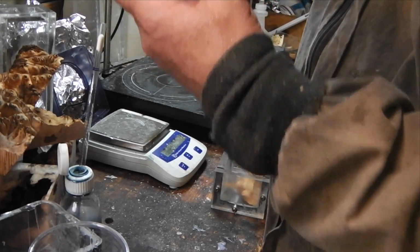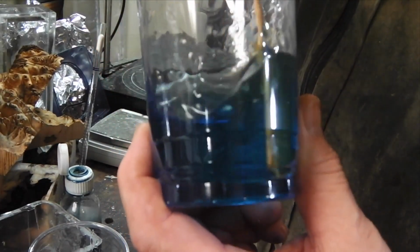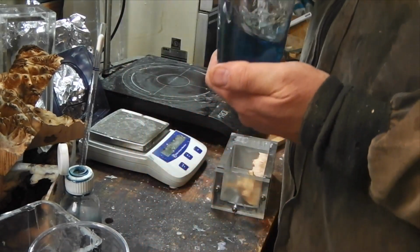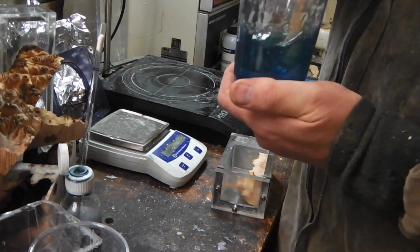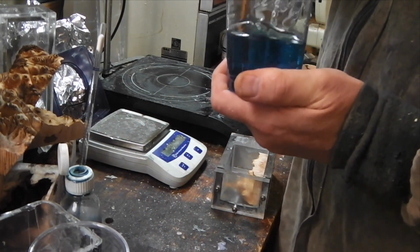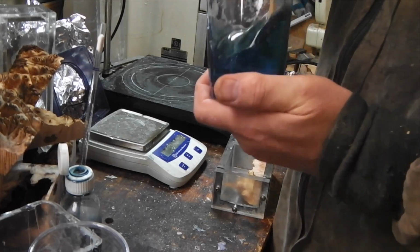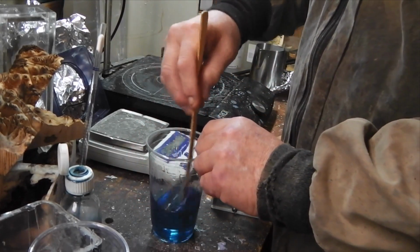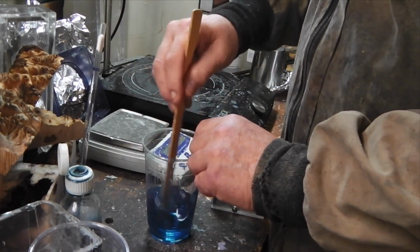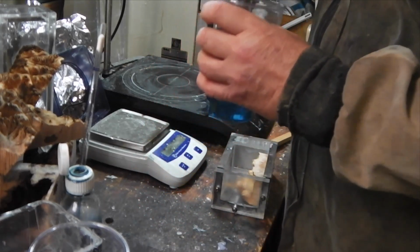And you can also see that there are a lot of bubbles coming out. Those bubbles are why the casting stage really needs to be done in a pressure pot. At a pressure of about 60 pounds per square inch, those bubbles go back into solution and you wind up with a nice clear Alumilite block.